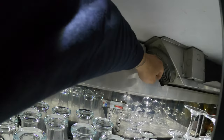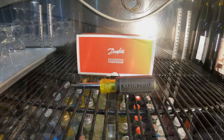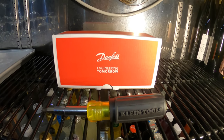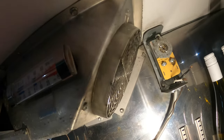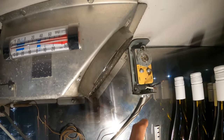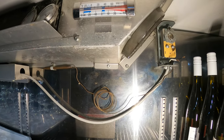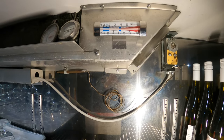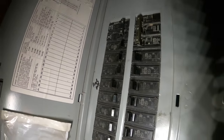The fan is running and we've got no cooling, but that's because the thermostat is disconnected. Alright guys, I just picked up a new thermostat — this is a Danfoss Refrigeration Mechanical Thermostat. Here's the thermostat and here's the sensing bulb. Now we know where the breaker is, of course — let's go ahead and turn it off once again. It's labeled 'low boy' — let's get started.